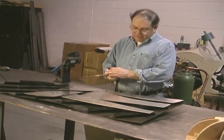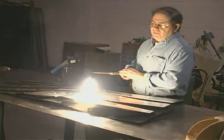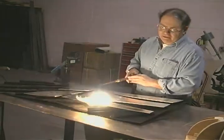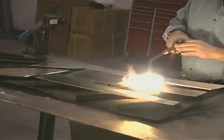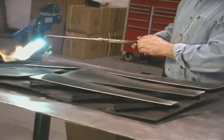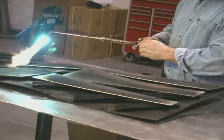I'm going to turn on the torch with a carbon-rich or acetylene-rich flame, and put a little deposit of carbon on here — it doesn't have to be on very thick. Now what happens is, if we go to a neutral flame and burn the carbon off, it will come off at 700 degrees, burn off at 700 degrees, and the metal will be soft. We'll let it cool on its own.